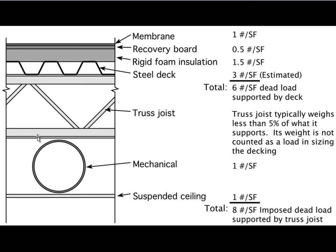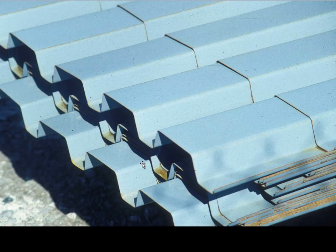We really have to worry about the roof flying away, so anchoring the roof down is a crucial part of the design. This corrugated decking on a roof almost never has concrete on it unless we intend to make that roof a floor in some future date, or unless we're trying to ballast the roof in high wind situations. So in a roofing configuration it's almost always rigid insulation attached to the corrugated decking.